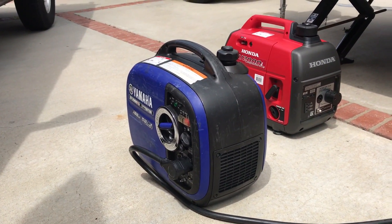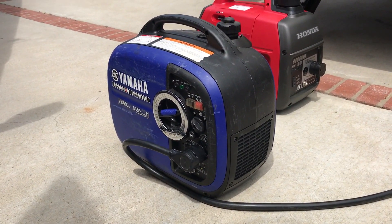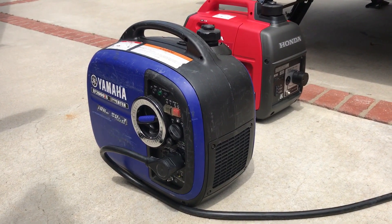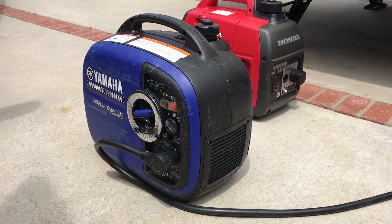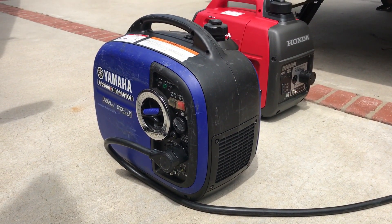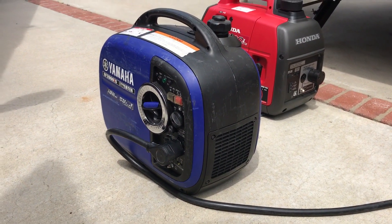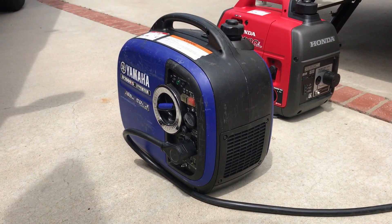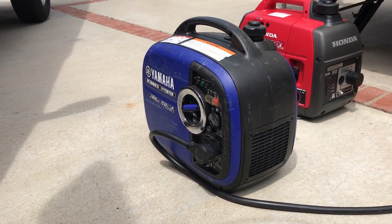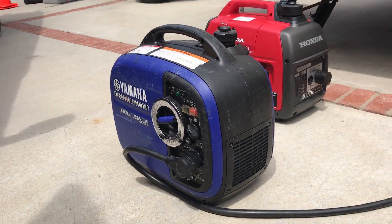Just my opinion — not that it matters much. Let's see if the Yamaha will start this AC unit on Eco mode. We'll see what it sounds like when it ramps up. We've got about another minute here. Right now it's just running the fan on the AC unit. The Hyper Engineering soft start kit is delaying the compressor on cycle — I believe it's three minutes.